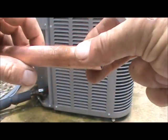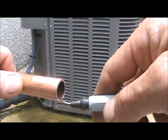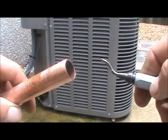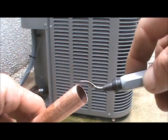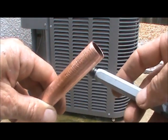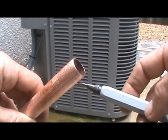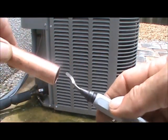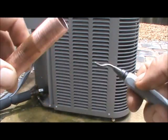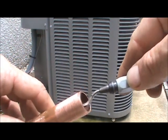If you just have a piece of pipe that's open on both ends, you don't have to pay attention to where all those shavings go. But if you are working on a system where it's only one end of the pipe that you're working on and the pipe is in an upward position and you start to deburr, all those shavings are going to fall back down inside of the pipe and cause problems in the future. So it's best if you get your vacuum, or if you can get the pipe in a downward position when you do the deburring so the shavings fall out, or you hold your vacuum up close to suck any of those pieces that come out.